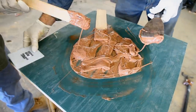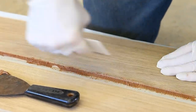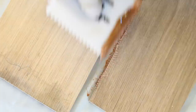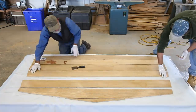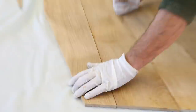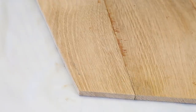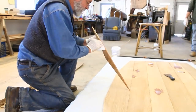You've got five layers of glue here, so you spread it out and start picking it up and troweling it onto the surface — tooth troweling it, because if you don't tooth trowel it, you get a different amount of glue in every spot. You have to use a tooth trowel when spreading it. We're using a tooth trowel now, spreading glue on the very edges first, which accounts for why we put the boards a little distance apart so we could spread glue on the edges and then just pull the piece over to the glue. I'm putting a little bit of glue on the last piece to make sure we get glue in the seams.